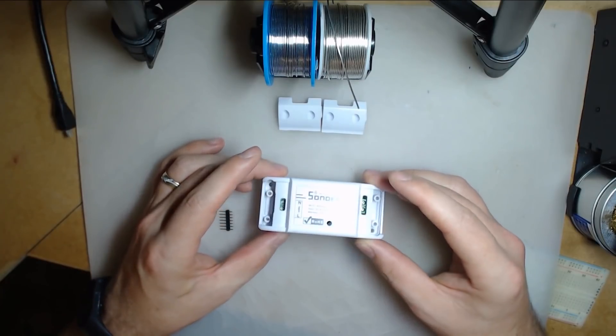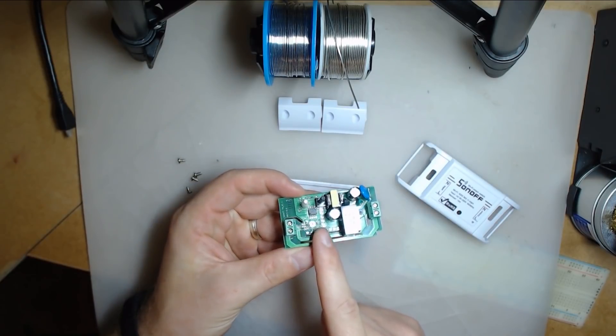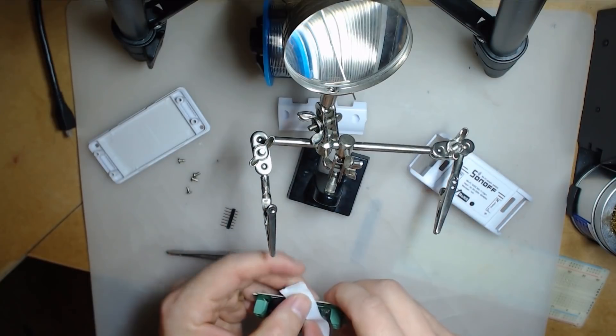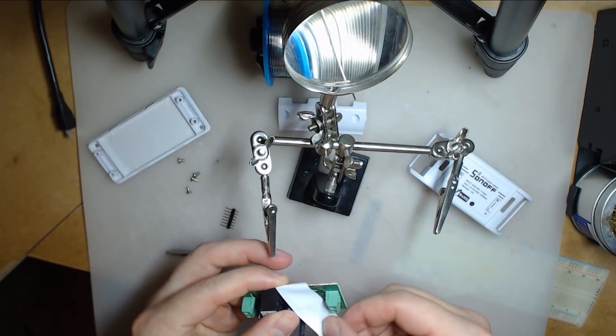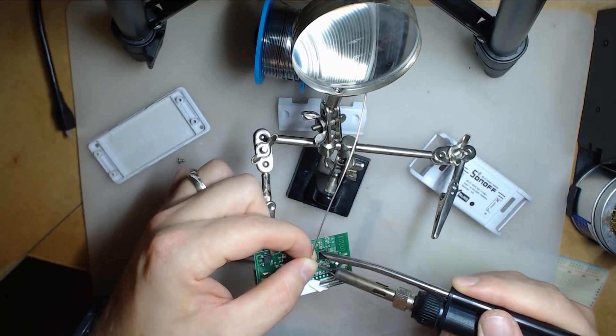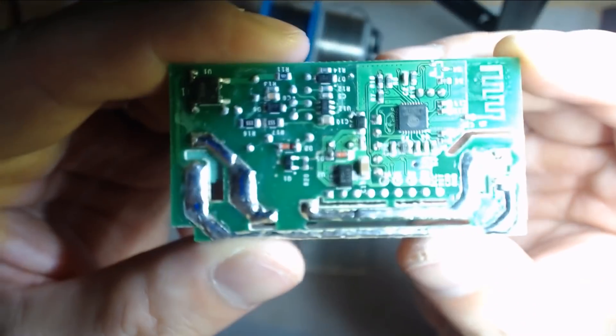To start, we're going to take this apart and add at least four pins — actually five pins, because one of them is a free GPIO 14. Just wrap things in security tape and solder the pins to the board. Once that job is done, we're going to have a look at the layout.